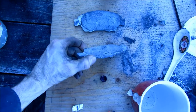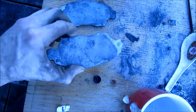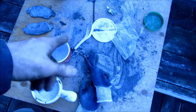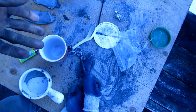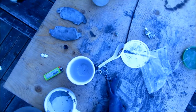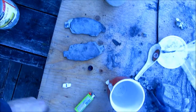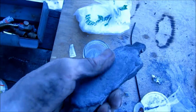Here's the finished product. This one's better than this one. It's kind of hard to mix the epoxy with the powder in a consistent way and then smear it on there. Like, I don't know if you should mix the epoxy — the black stuff — with the powders and then put it on and try to work the hardener, the white one, in afterwards, or if you should just mix it all together and hope to get it on before it hardens. I had a hard time doing it. I kind of got lucky on the first one and was able to get it on there pretty consistently — it turned out pretty nice.